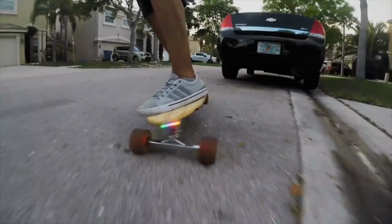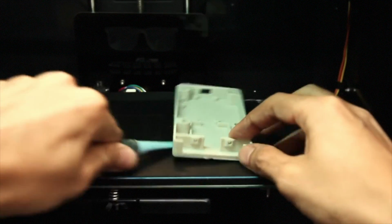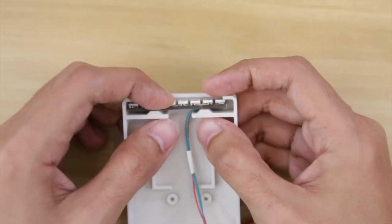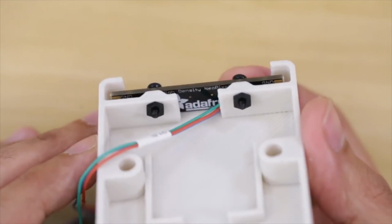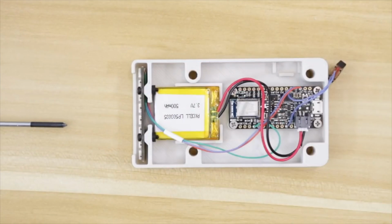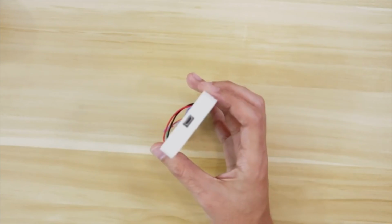And that's pretty badass. Second, the enclosure for this project isn't just a box, it's a masterclass in case design. Every element has a specific place to fit into. The board is screwed down so that its USB port faces out for recharging the battery. There's a little cubby for the slide switch. It's been reinforced in all the right areas to hopefully prevent it from cracking. It's a great design that you can learn a lot from.